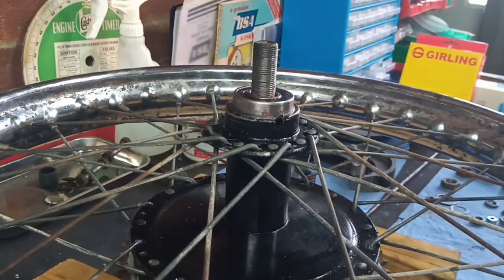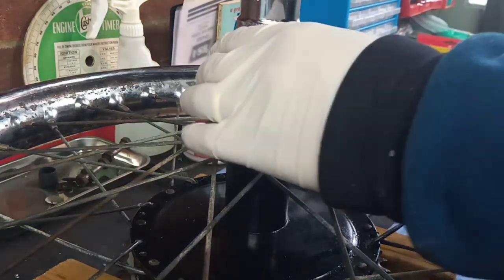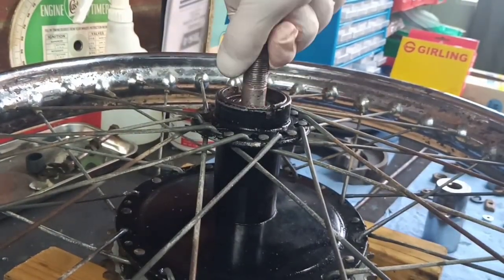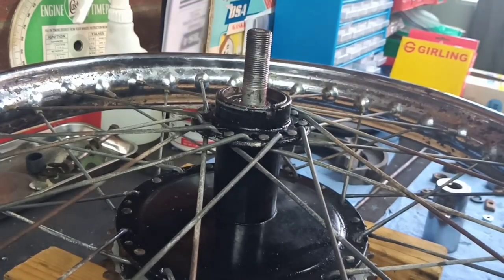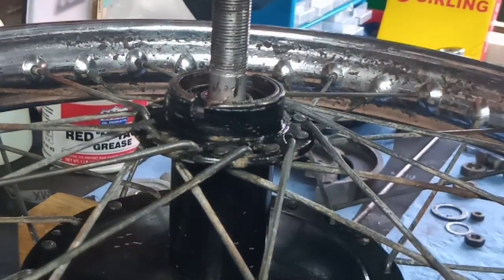I've got a socket that should do the job. We're on some wooden blocks so we're not going to damage anything on the underside or displace anything. The bearing went in, though it went in a little bit squint at first — not all the way down — but it's good to go now. Quite frankly I don't like that methodology of fitting bearings by hitting them — it's just something I don't like to do.